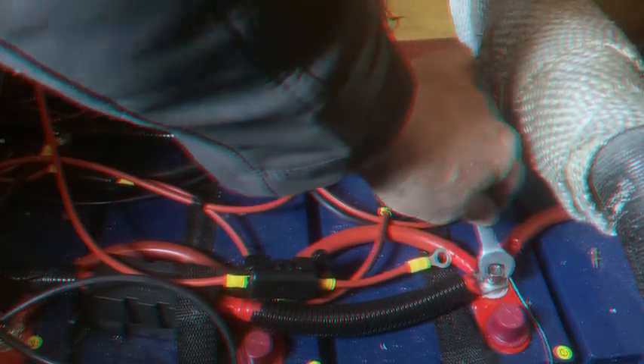I've been careful here because these batteries are in a steel box, so I've been very careful not to get that spanner anywhere near there. I've connected the input from the domestics, and you can see it needs a software update — that's pretty normal for MPPTs and Orions. Stay within distance of the unit and it does its own thing. You can also see that those Orions generally come configured as a power supply, so you have to change that to charger and put in the battery settings.